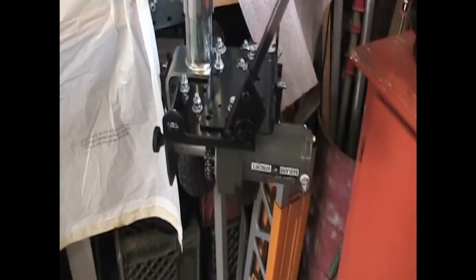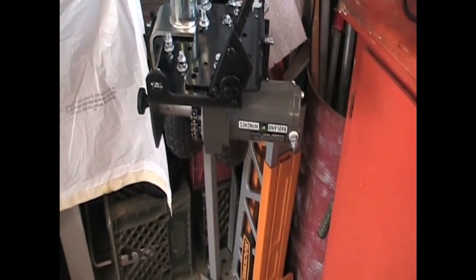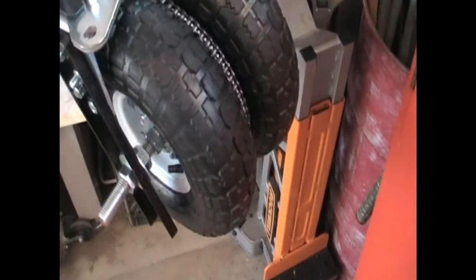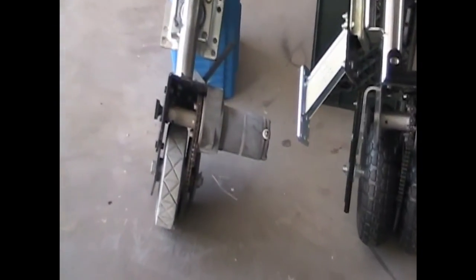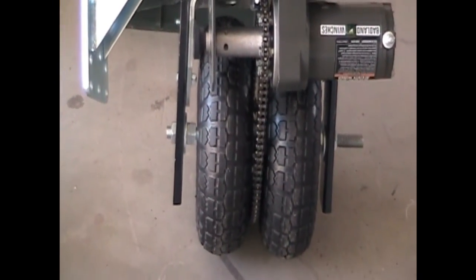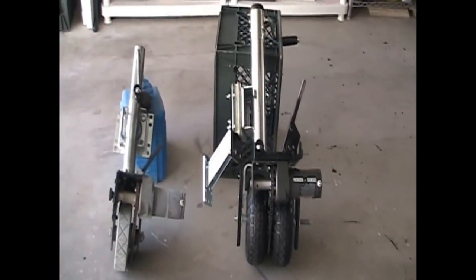There's the motor — a 2,500-pound winch motor with a little sprocket. Here's the new mule next to the old one. There's a considerable difference: the old one has a two-inch wide tire while the new one has two three-and-a-half-inch tires with mud lugs. The old one weighs 33 pounds and the new one weighs 49 pounds — the jack is a lot bigger, plus all the brackets and hardware.